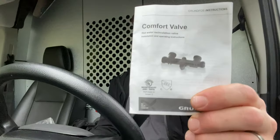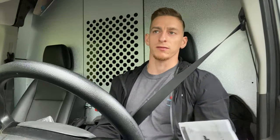So installing this recirc under the sink, this recirc manifold, is going to be the way to go. And it is a new install. This was part of it, just going back to finish this up because we didn't have the right fittings. I end up using flex hoses. I'll put in a press shut off, a press quarter turn stop, and then I'll use the flex hoses from that to adapt, get back up to the faucet. And there's a circulator in the water heater that recirculates through this manifold to keep the hot water there and ready to go. I'm gonna try to get some footage of the install, and pretty straight to the point here